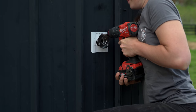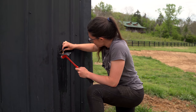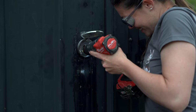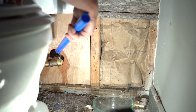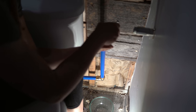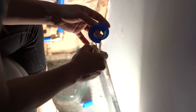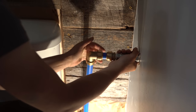We poke this in from the outside and make sure that everything lines up with the handy dandy mounting sticker that came with the system. We're first going to drill for the anchors. Once everything's drilled, we're going to get rid of the sticker and install the anchors. Then we put on the gasket, put this back through, and screw it all together. Now let's go hook it up from the inside. I've teed in from the outside line to the existing line in here, and I can just push this little piece of pipe into the fitting. Once we've got that in and it's the right length, we stick the next elbow on, then do the up one and another elbow up here. We'll put on a little bit of Teflon tape for the joint and then put this guy on. There it is — I think we should be good now.